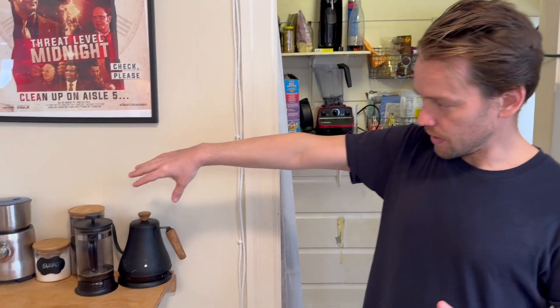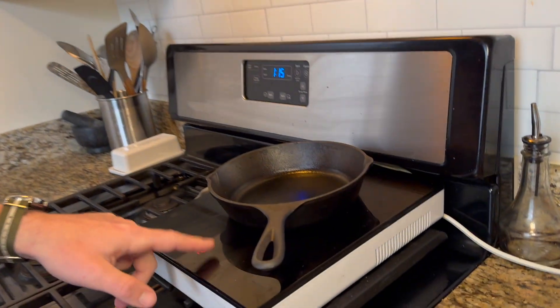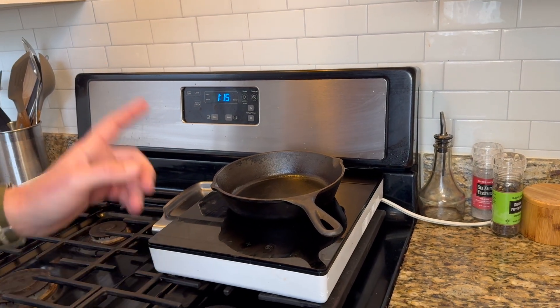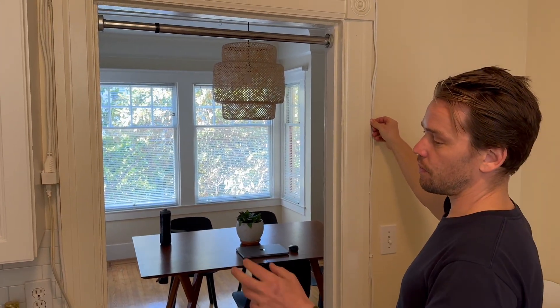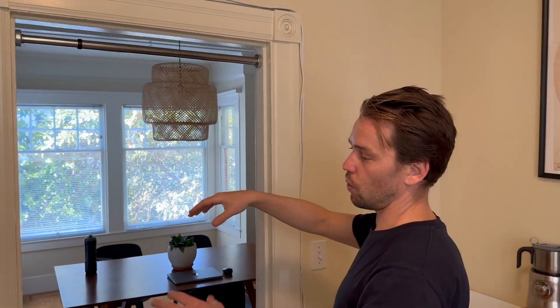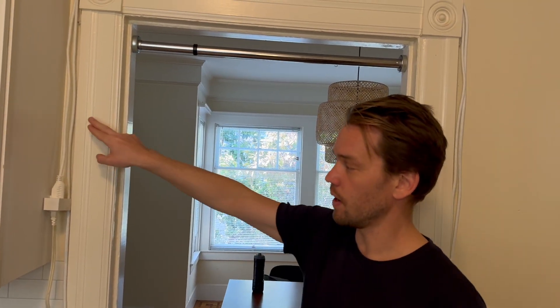The kettle and these heaters here could be plugged into the wall, but they run off my own system. These two cables continue on up through here and down to my stove — an IKEA induction stove that draws up to 1,000 or 1,200 watts. You want to be careful to have this on its own cable. That's why I have two cables as opposed to one with a switch, because if you run the stove and other loads through the same cable at the same time, the cable is only rated up to 1,700 watts and over distance only about 1,000 watts. You want to avoid overloading and overheating cables when putting bigger loads on them.